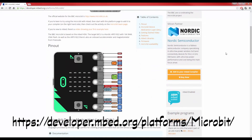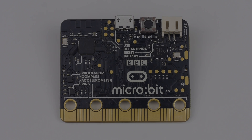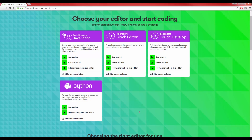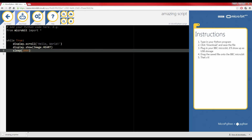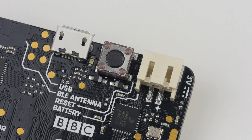The tech specs of these outputs can be found on the ARM Mbed website. So that was a rundown of the hardware, pretty much all of which is user programmable. But how does one actually code the micro:bit? As it is a microcontroller, it has to be programmed via USB from a host PC. There are four official code editors, all provided via the BBC website. You code in the browser, compile, and then drag-and-drop the hex file onto the micro:bit USB device. Then all you have to do is press the reset button and the code will run.